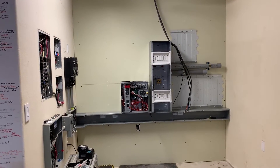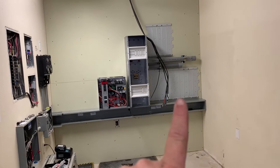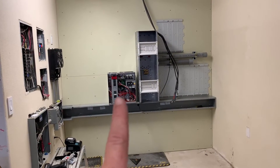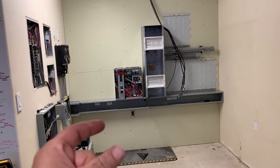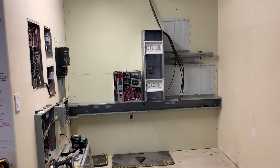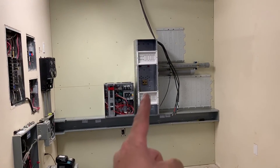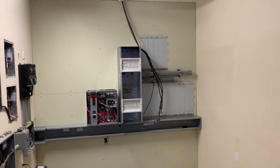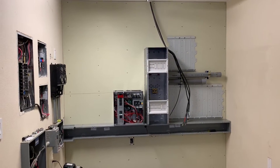What I wanted to do is make this wall strong, because I didn't know if I was actually able to hit studs going on this. I did wind up getting in the centers of them, but to really anchor some of this stuff it's off-center and the inverter weighs quite a bit. With the inch and a quarter of distance, I can do anything I want for placement. So far everything's working good. We're going to have our GSLC and our Radian, our FlexWare 1000. This will go up six inches so that everything's pretty close to even across the top. We're pretty much set to go rocking the lithium iron batteries.